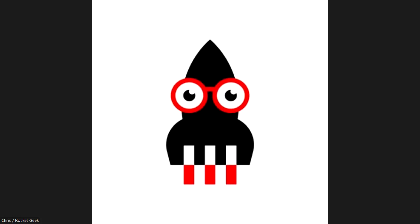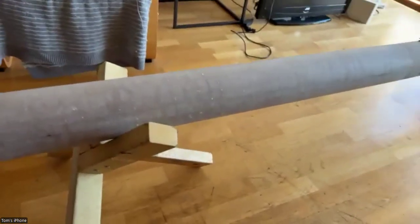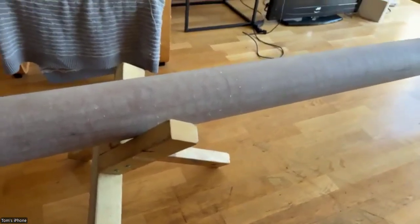Yeah, I was questioning more of where you are putting the tracker from an RF transparency perspective. Yeah, that's in the upper airframe, but halfway down in between the parachute bays. The phenolic and the fiberglass are transparent to radio waves, so that shouldn't be a problem.